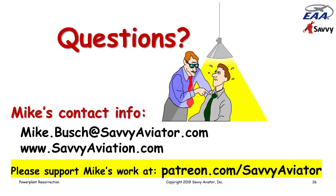Wayne is wondering, how long can oil sit before you should change it? The most common recommendation on that, and what we recommend to our clients, is that the oil should be changed at least 3 times a year, regardless of hours. In other words, every 4 months. So what we recommend to our clients who have engines with full flow spin on oil filters is to change the oil every 50 hours or 4 months, whichever comes first. So if they fly a lot, the 50 hours will come first. If they don't fly very much, the 4 months will come first. But we don't want oil sitting in the engine for a year.